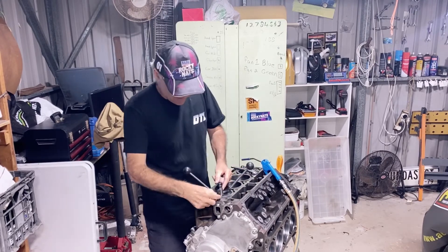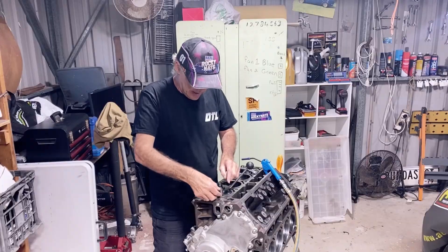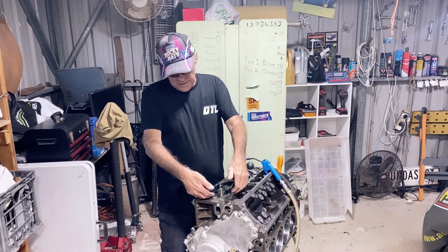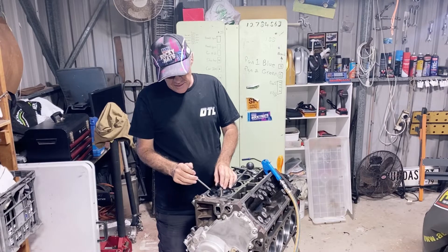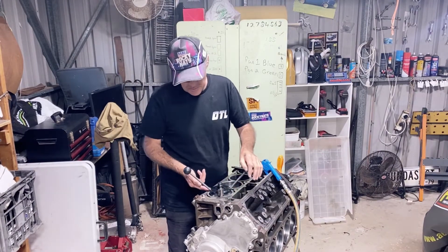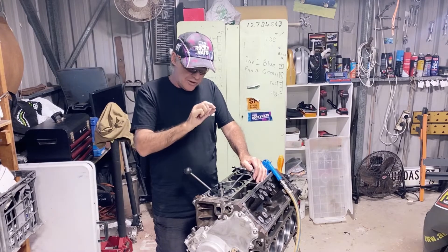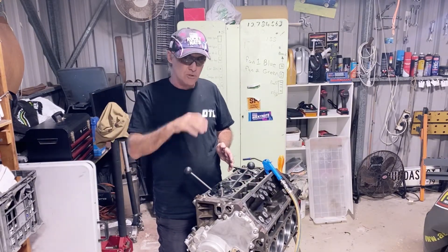There's actually a tool on a swinging arm with an Allen key. You set that out to your diameter of your bore, so that gets you the full circumference or whatever you want to cut. You then drop your tool down onto zero so it just touches the deck, because it sits on four little locating feet around diagonally opposite each other. We did a quick little scratch to make sure we're on the right diameter and have the clearances right. The next step was you just lift it up, put a five thou feeler gauge — we cut up a set of feeler gauges — one on each corner. Drop the cutting tool down and set it zero onto the deck.